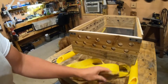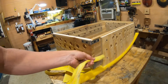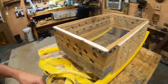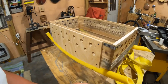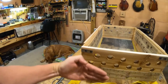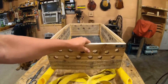We're going with this nylon strap instead of rope because it'll last longer. The last rope kept rubbing on the side and eventually wore through - took about a month. I'm going to drill holes in the sides and run the strap through. Don't run your rope through the front and pull off the front plate - that puts too much straight strain on the front. Run it through the side piece so it won't hurt the front of the sifter.